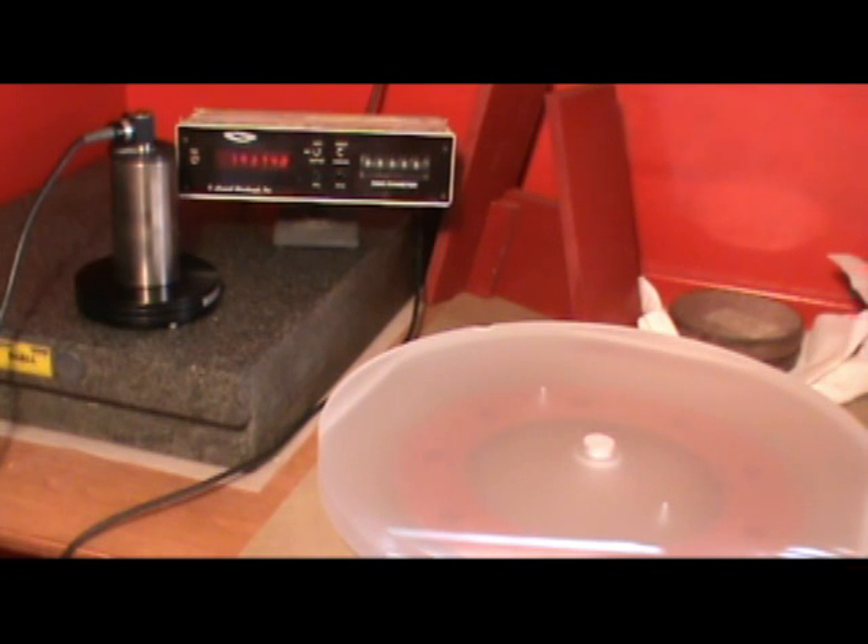One is to monitor the radius of curvature of a mirror to make sure that it's heading in the direction that I want at the speed that I expect. So ending up with a mirror at the correct radius of curvature is an important point. But the second reason I use spherometry is to make sure that the piece that I'm working on stays spherical. You'd like while you're grinding for a mirror to be spherical. It helps later on in polishing and also helps you in the fabrication to keep the fabrication moving along in the direction that you want.